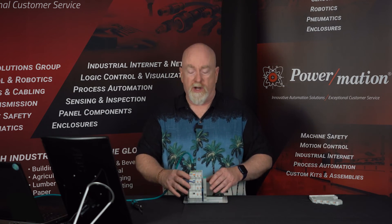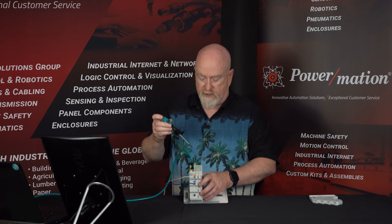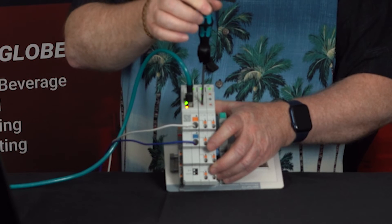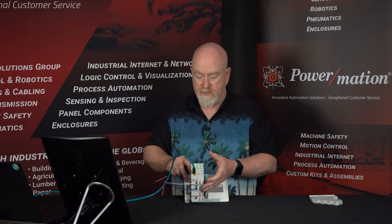After a quick break, I've assembled my Caprock on the DIN rail and the system is green, powered up, and ready to go. I have three channels currently active and I'm communicating to a PLCnext. On the PLCnext software screen you can see three channels enabled — two set to 4 amps and one set to 8 amps, matching what we see on the front of the Caprock. If I take my screwdriver and turn the second breaker — the one set to 8 amps — the indicator light flashes green telling me it's no longer at its set value. I press and hold the button, it goes solid green, and on the screen the value updates from 8 amps to 6 amps.